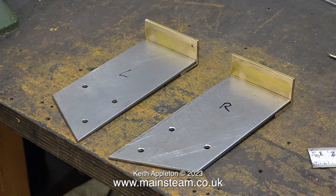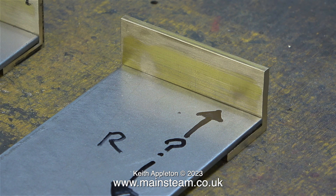I did exactly the same on the other bracket and as you can clearly see here they are a perfect fit on the uprights. To fix the pieces of brass to the uprights I'm going to use some 2BA hexagon bolts to hold all of the parts together. The holes in the brass angle that go through into the uprights are going to be in the same relative position as the bolts that hold the uprights to the main mounting bracket, so it should look good.